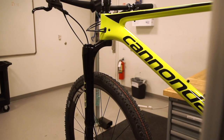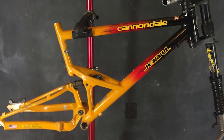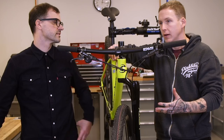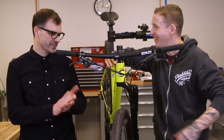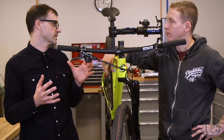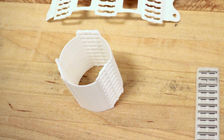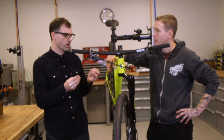This is a brand-new fork, but why invest so much time, development, money, and effort? There are a lot of good forks out there. One thing that Lefty has done that no other fork has done is excel at what we call loaded friction. When the fork is seeing loads and starting to bend, the roller bearings inside prevent virtually any friction, whereas a traditional fork with its bushings starts to get binding and really reduces that small-bump feel.